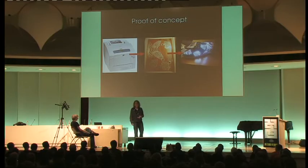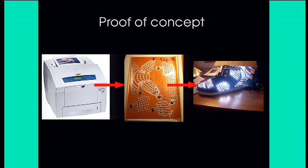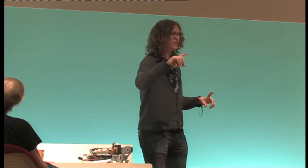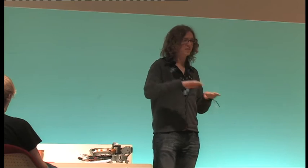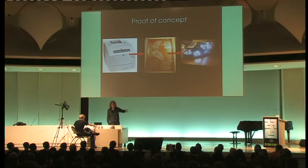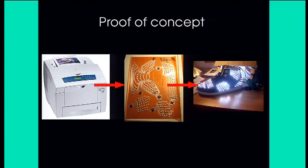Can you actually inkjet print wax? Yes. A while ago I had a crazy project making LED-covered shoes with no time to outsource flexible circuit production, so I bought a Xerox Phaser printer. Inside it contains an inkjet printer that prints liquid molten wax onto a drum and rolls it onto the page. I took flexible PCB laminate — plastic with a thin layer of copper — cut it into A4 sheets, loaded it into the printer, clicked print, and it came out with a perfect wax image on clean copper. I etched it, soldered it, and ended up with a working PCB. So we know: one, you can inkjet print wax; and two, wax is an effective etch resist.